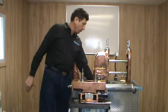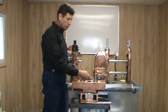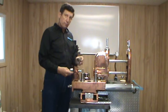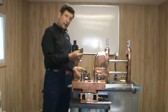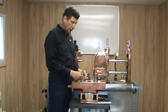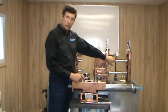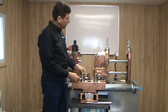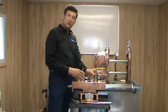Check the OD of the shafts. If we have sealed bearings like we see here on these particular side rolls, the typical wear will be at the pressure points where the bearing race pushes on the inside. Sometimes side rolls incorporate bearings where the shaft itself is the actual inside race; other times they'll have an actual inside race that slides on the shaft. Whichever the case, check the OD of the shaft for deep lines or grooves — the same way we check driven shafts in earlier videos. Take your micrometer and do the same type of check: one thou per one inch of shaft is the undersized tolerance to use. Replace these shafts as needed.